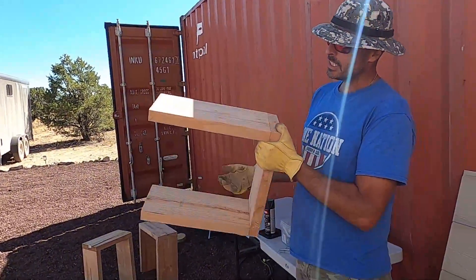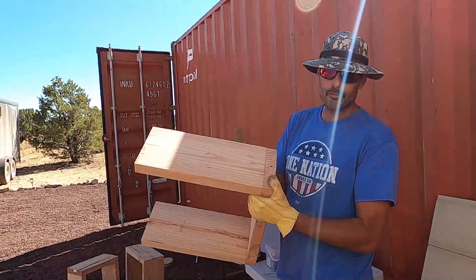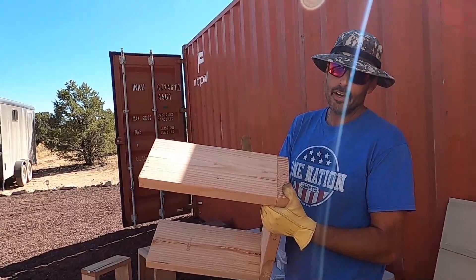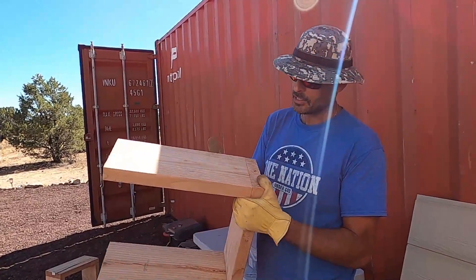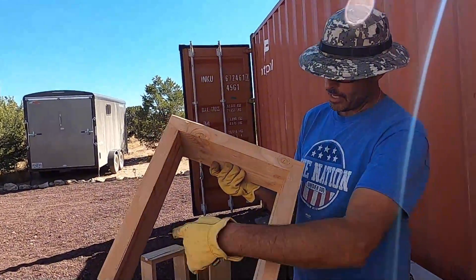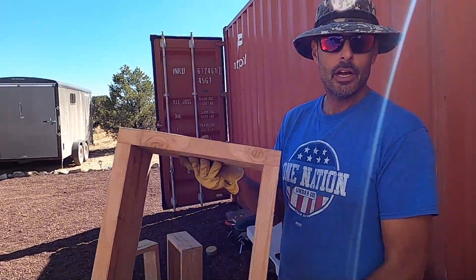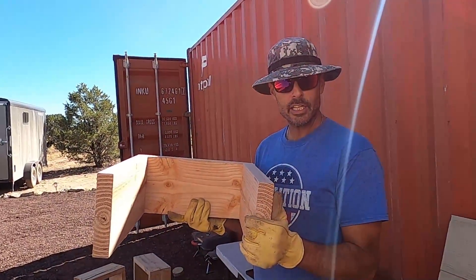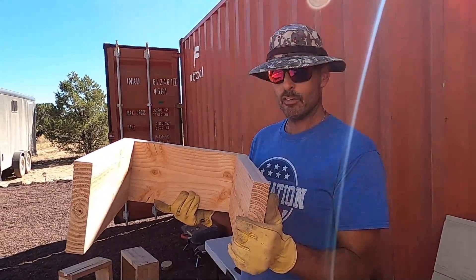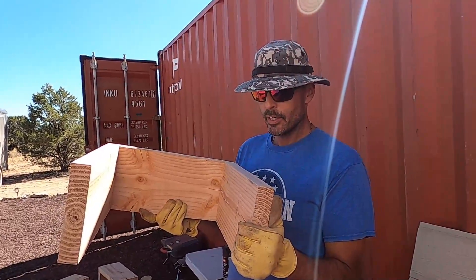Basically what happened is I had cut a bunch of 16-inch blocks on 2x8s for the RV, but I didn't take measurements of the blocks I already had. The blocks I already had were actually 20 inches long and 10 inches wide, so those wouldn't work — but it works out perfectly because they fit right over the valves. The valves take up a small area and there's going to be about a 4-inch area all the way around for insulation. I'm going to pack them with fiberglass insulation — I have a roll of R13 and I'm going to basically triple it, which will give me an R-value of around 39.